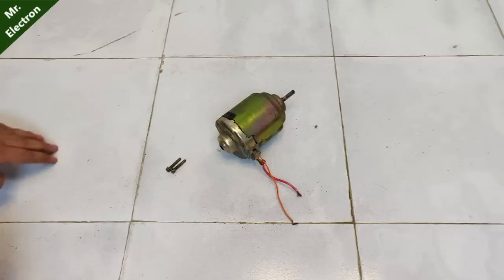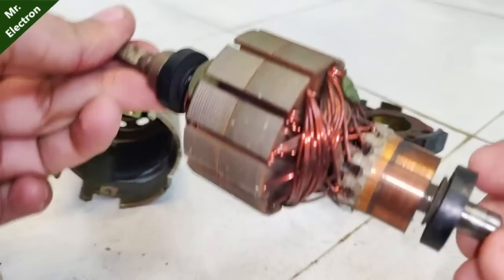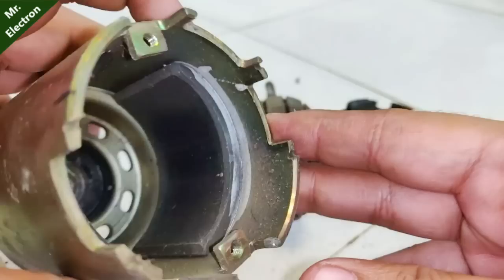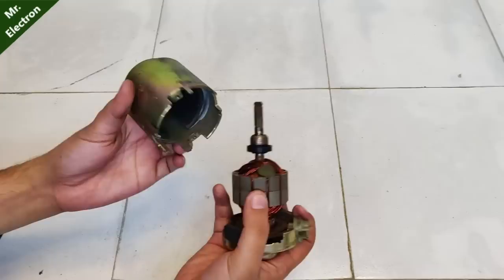Let's open it up and see how the armature and magnets look from inside, and whether it contains ball bearings or bushes. We also need to make a permanent marker mark because it will be difficult to close otherwise. It is open now — that's the armature. The copper wires are really thick and it looks like new from inside. The magnets are in good condition, and the brushes are also very healthy — pretty big brushes used to carry that huge current.